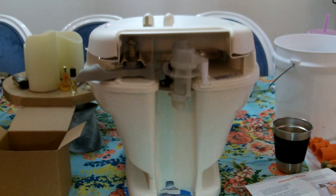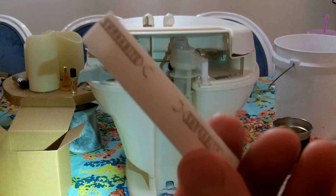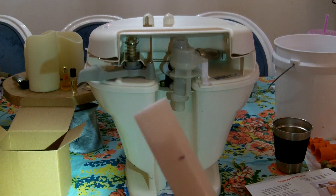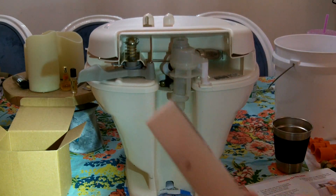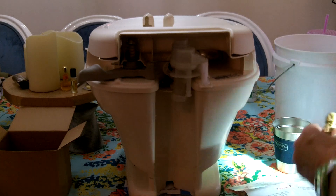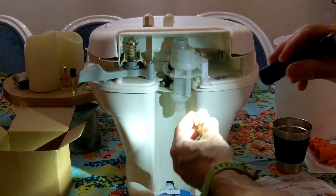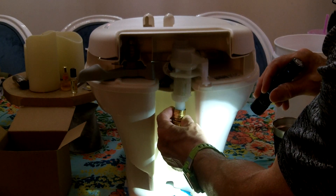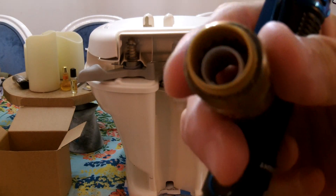It's hard to see on the camera, but it's right here. I removed this the other day and took the whole toilet off. What I did last time was replace some PEX line behind the toilet and put in some elbows and different things. I ended up just cutting the line and I'm going to put some new pieces of PEX pipe in. This is the SharkBite fitting I have — it'll screw on and then my PEX pipe will go right in there.